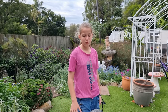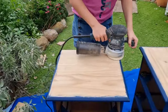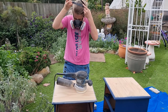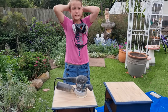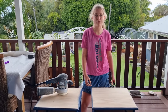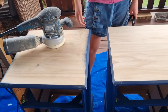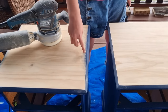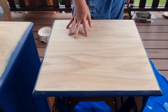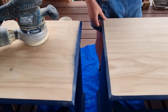I'm going to be sanding down my piece with a 240 grit to make it nice and smooth. This is a tip from Rochelle from My Lane that I learnt — she doesn't use tape to prevent the paint going on the real wood. So see how I got the paint on the edge here? It doesn't matter, because when you do your 240 grit sand, look how beautiful those lines come up. So that saves you time and money because you're not wasting it on tape.